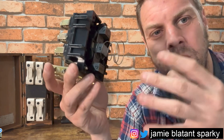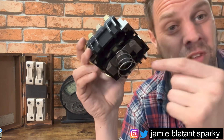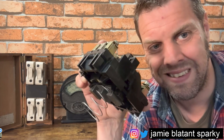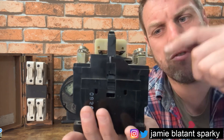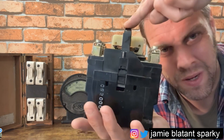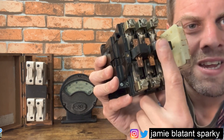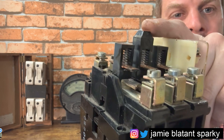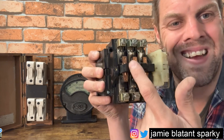So now we're going to put that back together. We know that the coil makes these laminates come together. There's a spring return here to make it open itself and put it back. So that's back together now - you can see the action. The electromagnetic switch in there wants to drag this down when it's energized. When energized it pulls the mechanics down - I know it's all black but it pulls it down - and that is connected to these three contacts here which are your L1, your L2, and your L3. So when you energize the coil, it pulls these down and closes them.